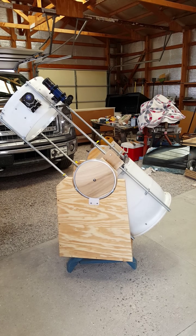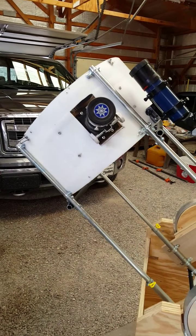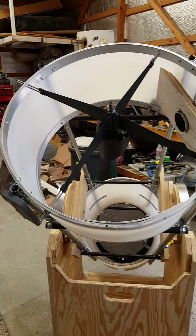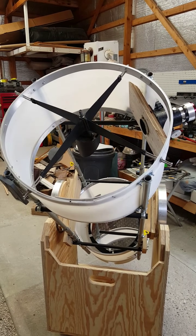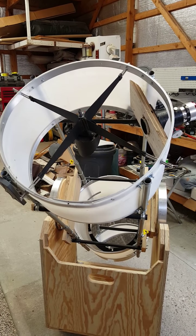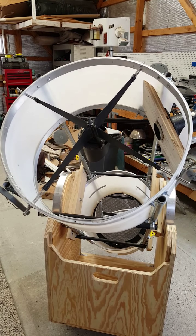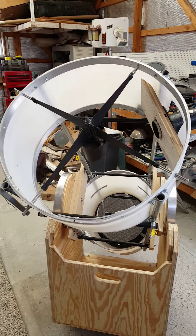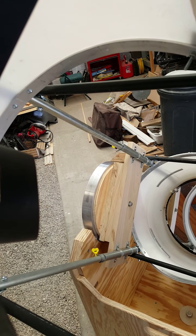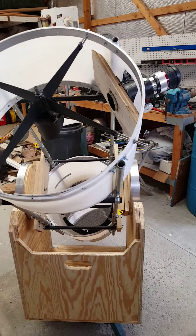As you can see, the upper and bottom parts are parts of a 30-gallon barrel. The problem with using a 30-gallon barrel is that when you cut it, it will not stay round. So I have tube stiffening rings in it made out of aluminum — one on the top and one on the bottom. These are half-inch bar stock aluminum, and in the bottom section I have a one-inch bar stock aluminum. These are pop riveted to the OTA.